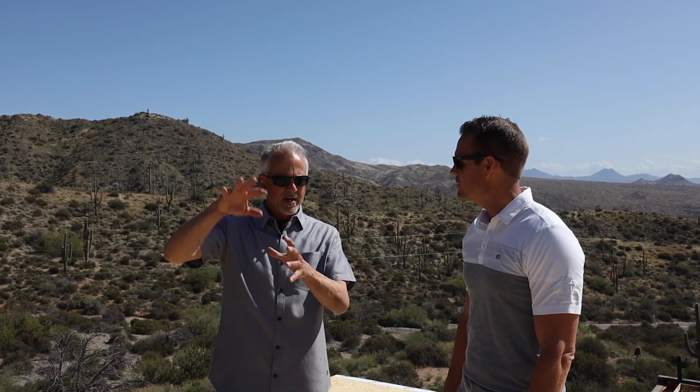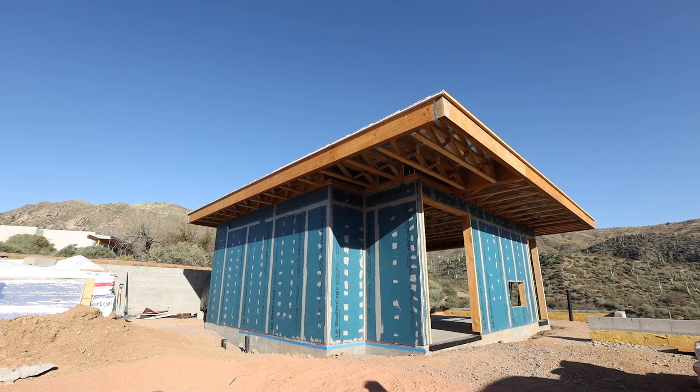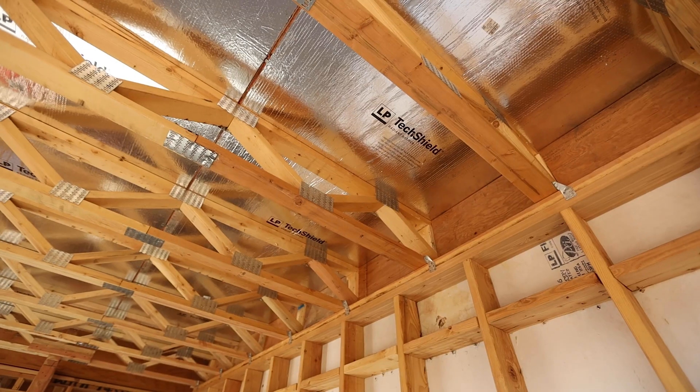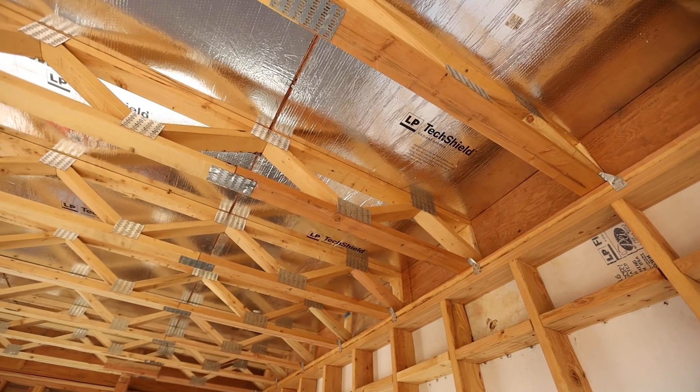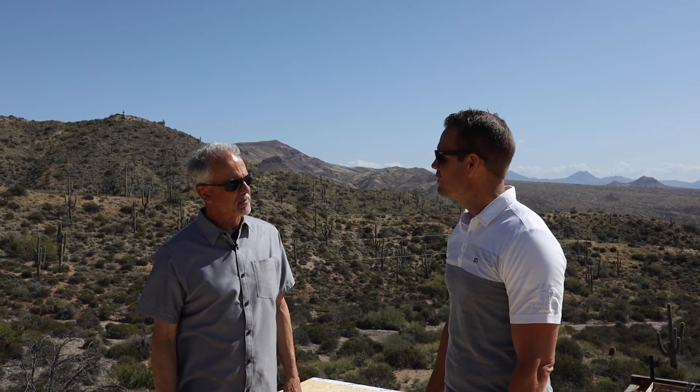With the WeatherLogic product — their blue exterior sheathing skin product — we did both the fluid applied and the tape on those seams as well. Think about your exterior sheathing acting as a water control layer initially, and then we probably put a rain screen over the top of that. We used the TechShield on the roof deck of the other Casita as a reflective radiant barrier. There's a nice mix of durability and performance. We always looked at this as nothing more than a 7/16 sheet of wood, and now they take on a higher function — which is pretty cool. Let's go over to the tape side.